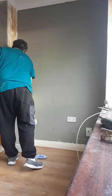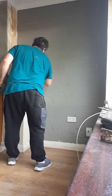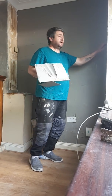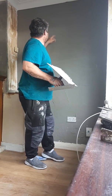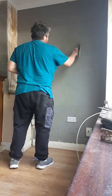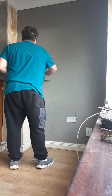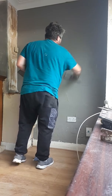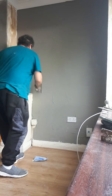The reason we polybonded this wall so heavy was because we found on another wall that the original board was starting to bubble. Not just the paper that was on it, but the actual board, the plasterboard. And we have a few of them here. So all we have to do is let them go a bit harder. We cut them, press them in, and then eventually we'll fill them up and down. But you shouldn't generally have to worry about that. That shouldn't be something that's going to hurt a lot.